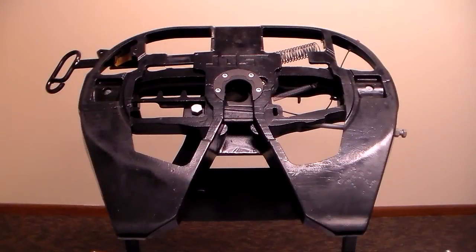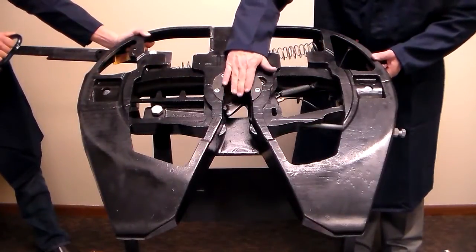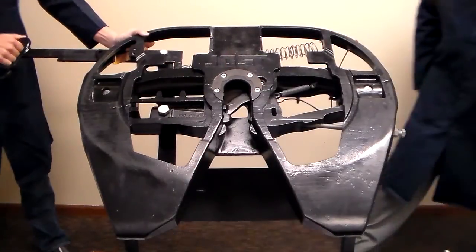Check if the lock is damaged or if debris is interfering with the lock operation. Have an assistant pull the release handle out while attempting to swing the lockjaw. The lockjaw should swing freely. Then lock and unlock the fifth wheel using a lock tester.